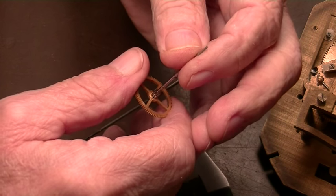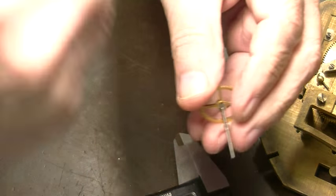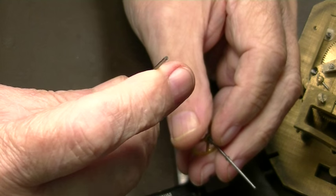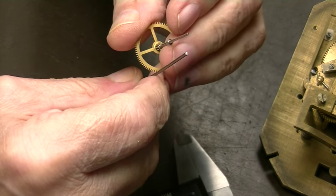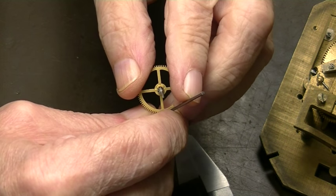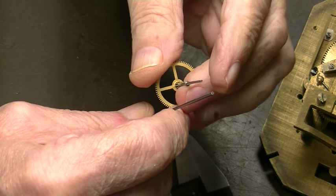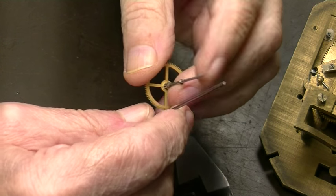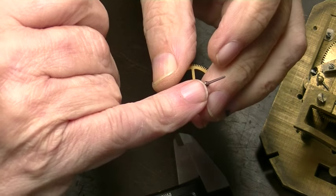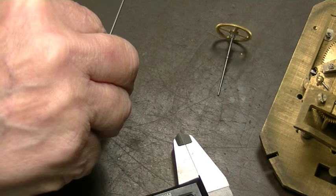The first time they put a collet pin through it, it broke. So what we're going to do: we're going to take a piece of pivot wire — you've seen that before — we're going to anneal it, soften it, then drill a 30 thousandths hole through the end of this. Then we'll put a tenon on the end of it, cut this off the right length, drill a hole in here, and put that in there.